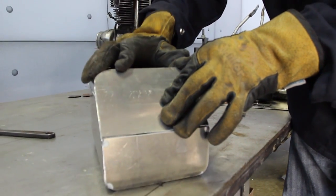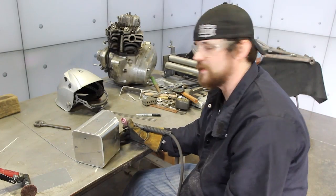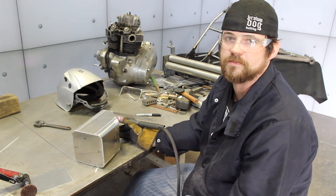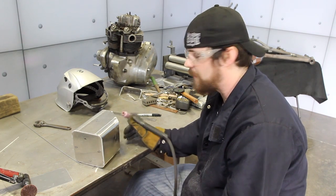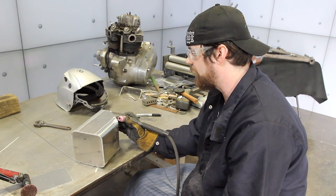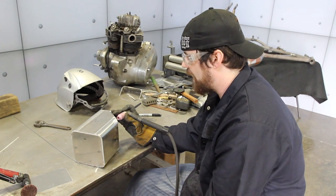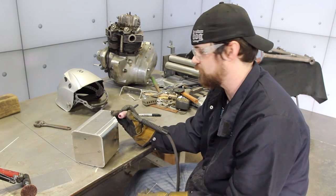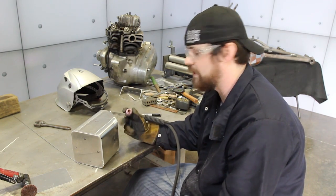I'm going to shorten this so that the lip is below this edge here so you have a nice seam to weld — get a nice flat weld there. What I did here is I fixed an edge. When I made a cut I cut it a little bit too far, and there's a little trick to fixing edges, whether it's aluminum or tool steel or any kind of steel really. If possible you want to hold the torch at an angle so your tungsten is pointing up towards the edge or almost parallel with the edge, and then you can feed the filler in from the back side. That way you're not eating into the base metal — you're adding the filler onto the top of it because you're not so worried about getting really deep penetration. You want to add that metal to the edge without getting undercut, and then you can smooth it flat and get a nice clean edge.